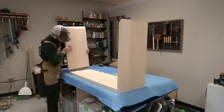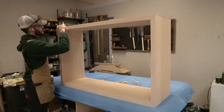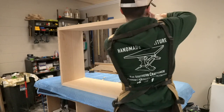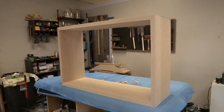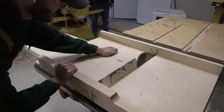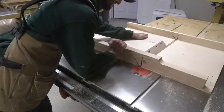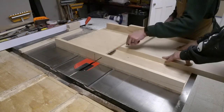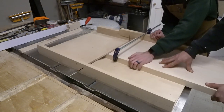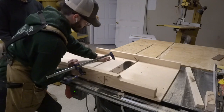I'm just doing a test fit here, and during this test fit — as you can see as I'm trying to punch these panels into place — I realized that my miters were not tight. So my solution, which is probably what I should have done in the first place, was to take them back to the table saw where I know I can get a good true 45. I could have gotten a true 45 with the track saw, but I did not check for square or proper 45. So here we are doing everything twice — learn from my mistakes — making fresh cuts.